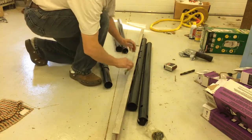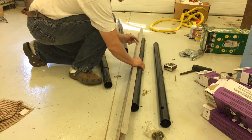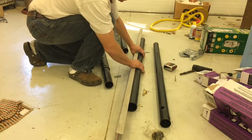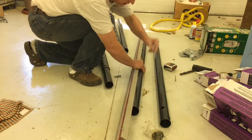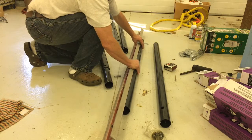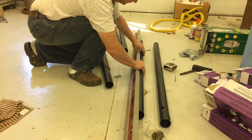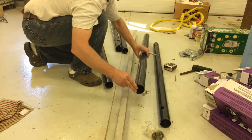Right now I don't know how many holes I'm going to drill, so I'm just going to draw my line. I've got roughly the edge of the level going through the center of these pinholes, so I'll just draw a straight line. All you have to do is roll the level and the tube together, line it up with the center of the other pinholes, and continue on. Make sure that your level and tube is seated properly, get to the next center of the holes, and draw the line. Really not that difficult, but if you're trying to do this freehand your pinholes probably won't line up right.